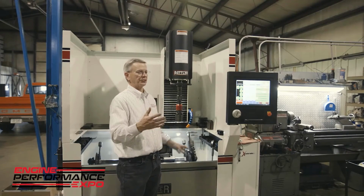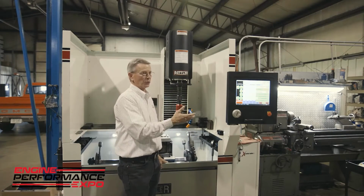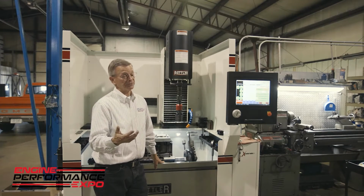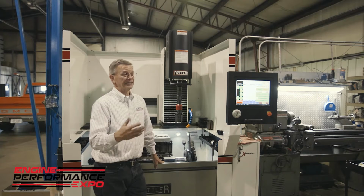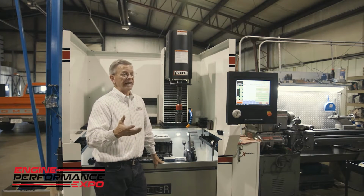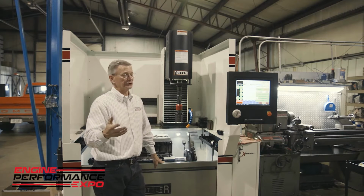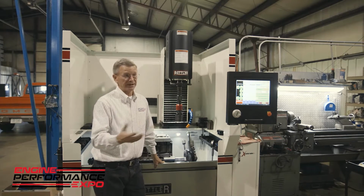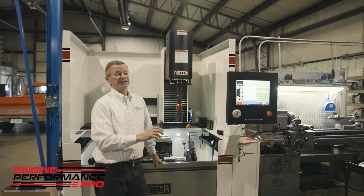So typically when a guy puts more pressure on the cylinder wall or on the honing head, all he's doing is really burning up more abrasives. It won't make a difference as far as a higher RVK number. It might make a point or two, but not enough to really mess with, in my opinion. So I tell customers constantly, no, it's not going to make a difference.